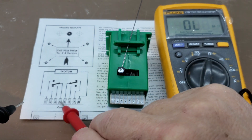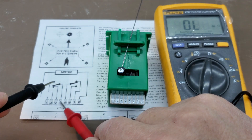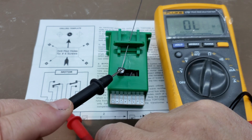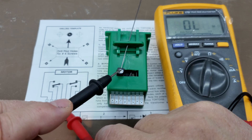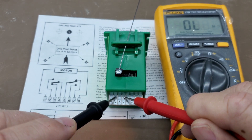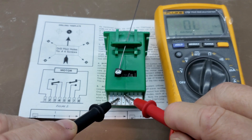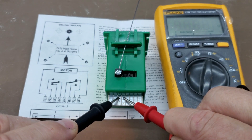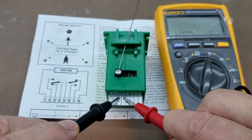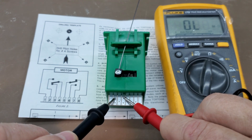The important thing is: pin 4 is the 5-volt supply, and pin 2 or pin 3 — depending on how the switch is thrown — will make contact with the 5-volt supply on pin 4. Once you have the Tortoise machine installed and set for the normal route, check your resistance values. When you have continuity on pin 3, connect the green side of the LED to pin 3, and connect the red side of the LED to pin 2.